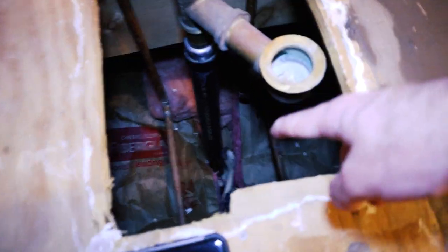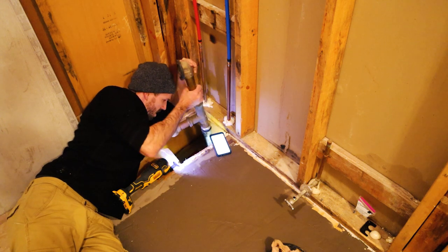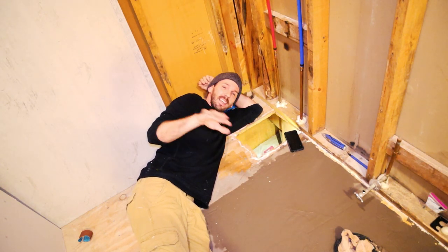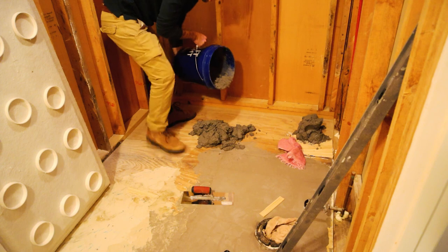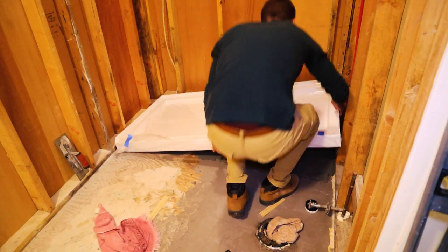I had always wanted a dog to hang out on job sites with me, but this is why I end up leaving them at home. Everything started adding up as far as problems: the leveling isn't right, then the dog walks in it, then I find out my shower pan drain hole is 12 inches from the front wall, right where a joist is. Just one more thing after another to tackle. I'm not going to show exactly what I'm doing down here as it may or may not be according to code. I'm basically adding a mud bed for the pan to rest on, which will prevent creaking and rocking in the future and also helps with leveling.